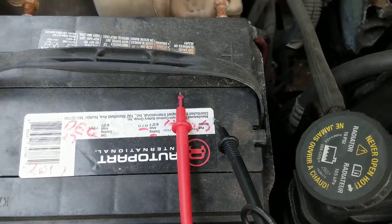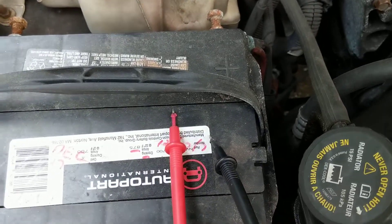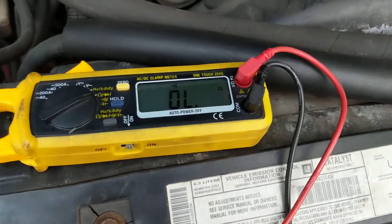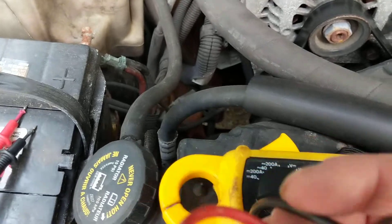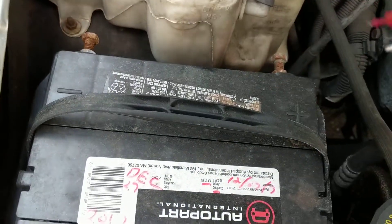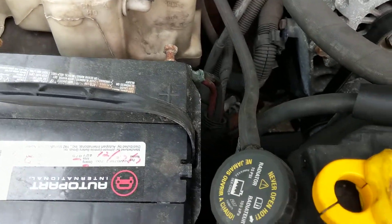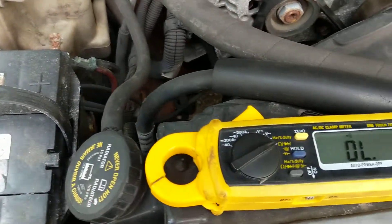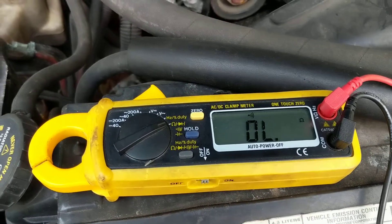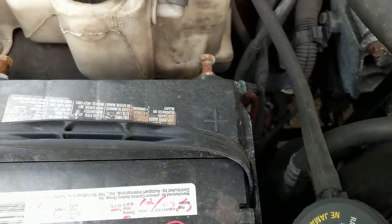To begin with, when you measure voltage with a meter like I have here, the first thing you always do is put the ground probe first. If I want to measure the car battery, I always put negative first, then positive. Why? If I don't put negative first, I become ground — the current goes through me and I complete the path. How much current depends on the resistance in my body.